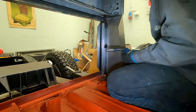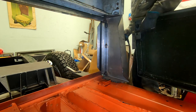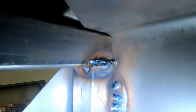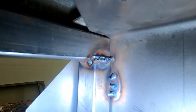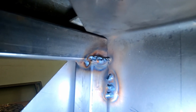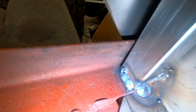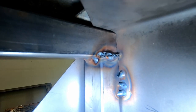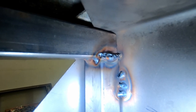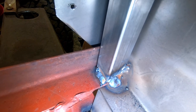Sometimes when I weld, the welds look like this. They're full of pores. Look awful. And sometimes when I weld, they look like this. I mean, what's the difference? Here and here. Huh. Old Swede garage, you might be able to tell me why. This looks like there's no welding gas. And this looks like my ordinary welds. Okay-ish.